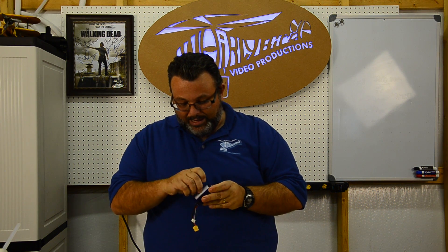This is a high-discharge LiPo battery and a high-charge battery. This is the Nanotech, 1300 milliamp, 45-90C. One times the cell capacity would be 1.3 amps. You'd set your charger at 3-cell LiPo at 1.3 amps — that's one times the cell capacity. This particular battery, you can go way up on your charger. If I remember correctly, it was 5 or even 10 times the cell capacity. I really wouldn't charge that high because I like my batteries to last, but I'd have no problem charging this battery at 3 amps. That's more than 1C but nowhere near the 10C maximum.